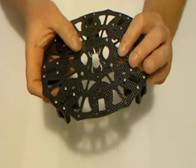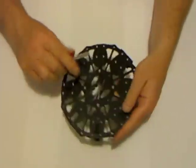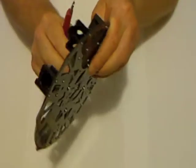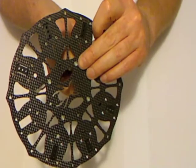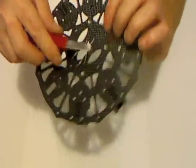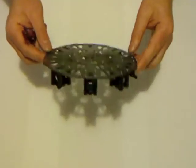One thing I've done as the first tip and trick is I've actually taken a knife, pushing away from me, and trimmed off the tips of the nylon standoffs. Usually you get about 3, 4, sometimes up to 5mm worth of nylon protruding proud of the metal standoffs when they're done. So the first thing I do when I've used those is trim that off with a knife, always pushing away from me and being very careful doing it, because one slip and you'll bleed. It just gives a bit of a smoother finish.